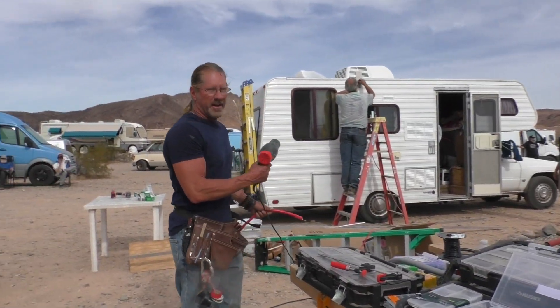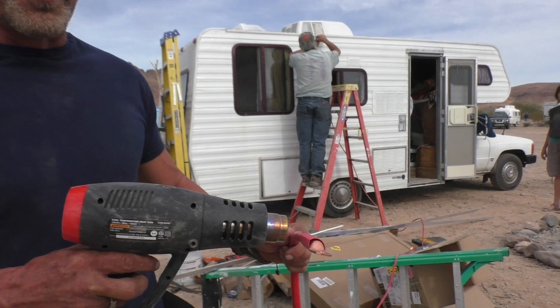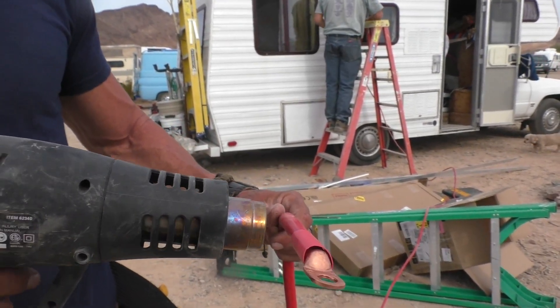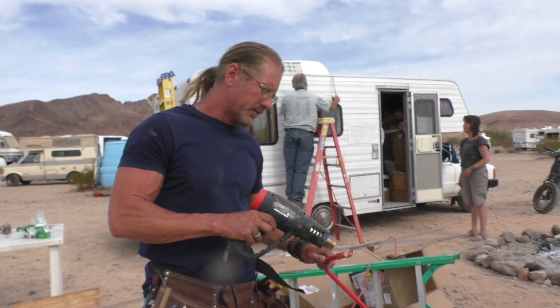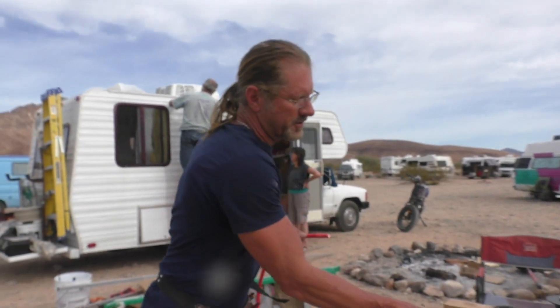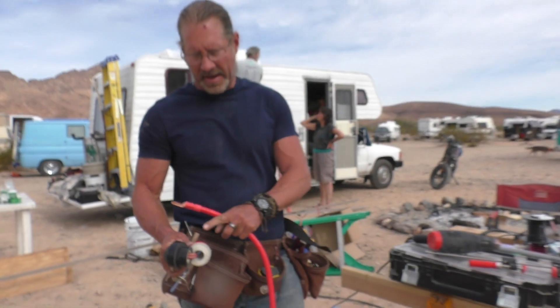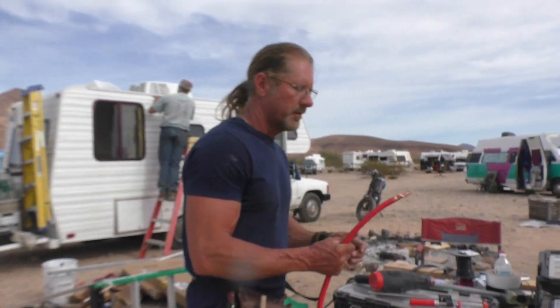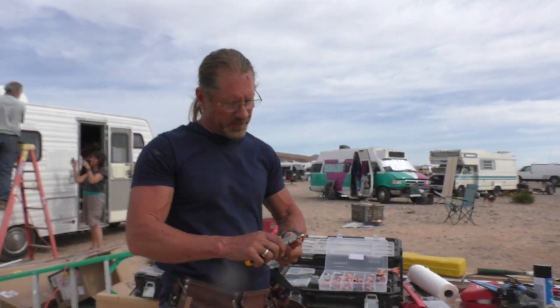With that, I'll take my heat gun — I'll put a link up to a heat gun for you — and we just want to keep the heat gun moving because it gets really hot. We want to hit every part of the shrink wrap so we shrink it evenly around the lug and the wire. You see that I'm matching the shrink wrap color with the color of the wire to denote that it's positive. But if all you have is black, it's okay to use black. If you don't have the shrink wrap or the gun or any of that fancy stuff, you could just use electrical tape. I'll finish up this one and bring it in to Donnie to see what he wants me to make next.